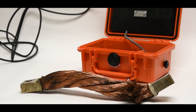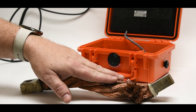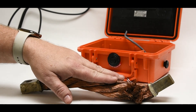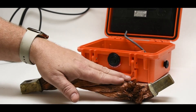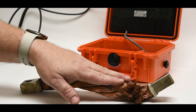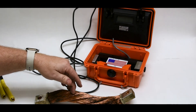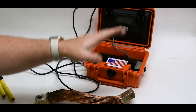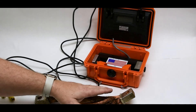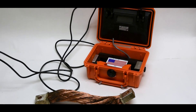Now let's observe the reading on a cable that is also 1,000 MCM by 12 inches long, but this cable is worn out — it's been in production. You can see how the cable has been frayed and broken. And by the way, while the cables can discolor and burn up, most of the time where the cable fails is in the crimp joint, and that's due to the movement of the cable as the welding occurs back and forth day in and day out.